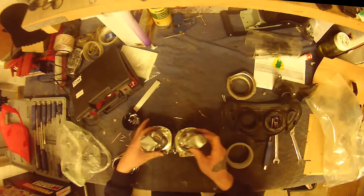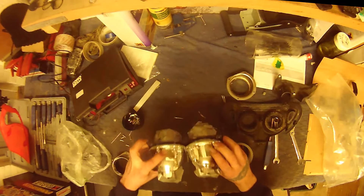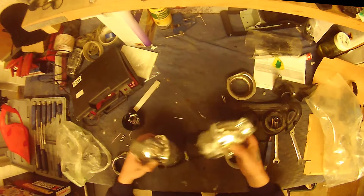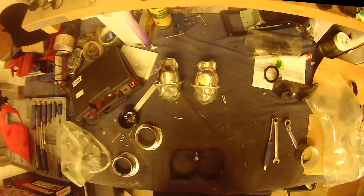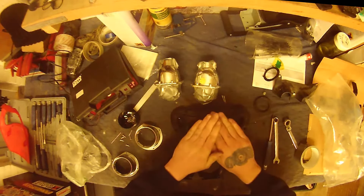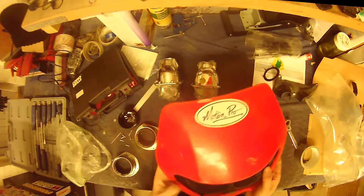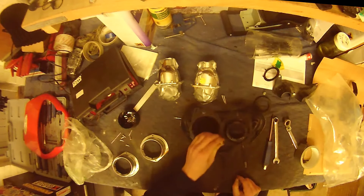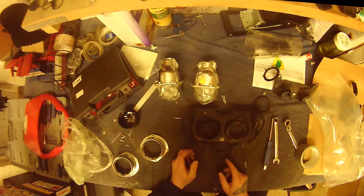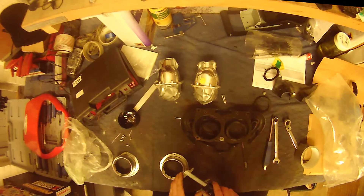I've taken a big chunk out of that one and a little bit out of the other one — we're definitely getting somewhere. Both mount in there but they're going to stick out quite proud. I'll probably be using fibreglass and framing it all better, but as long as they only come out below the line that's not a problem. Now, how am I going to cut the holes? I'm thinking a core drill — I said a number before but I can't remember; was it 80-something? If I do 80mm that's a big core drill.